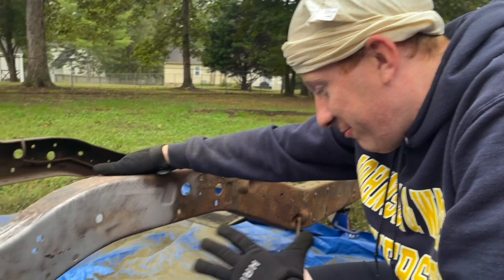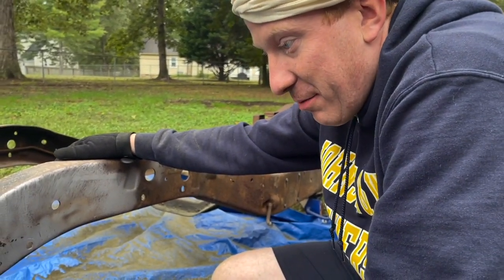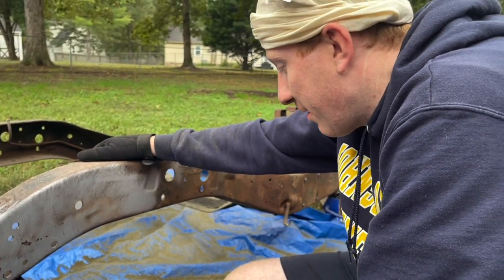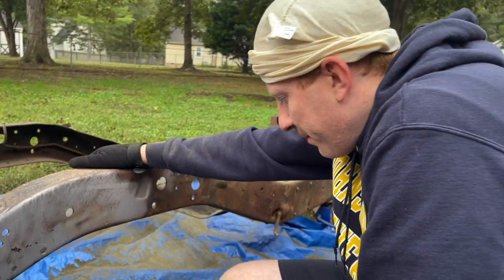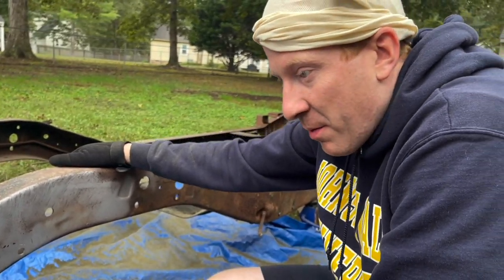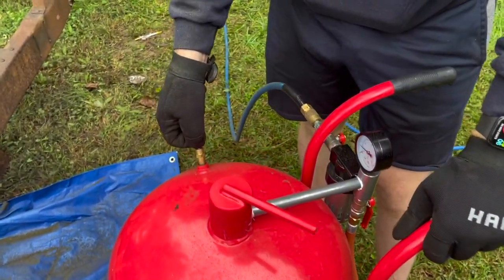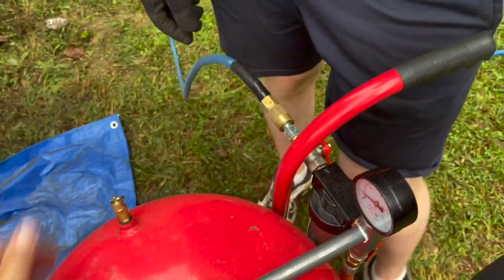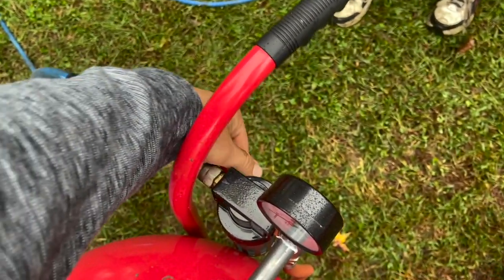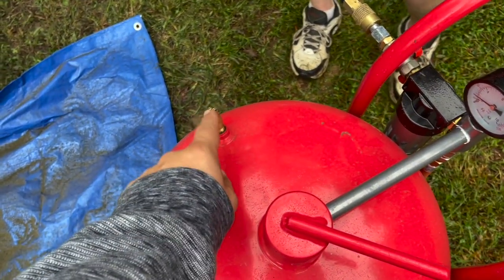That worked really well. What we put in already, I think we're already out — that was really quick. We're going to have to recycle a lot of this. From what I hear, you can recycle the media a couple times until it kind of stops working. It is a little rainy today, which could clog it up a bit. When you refill it, you pull the valve to release the air — make sure your valves are down and shut off before you do that. Don't just unscrew the top; if you do, it's going to blow sand right up in your face and you might go blind. Make sure you release the pressure first.